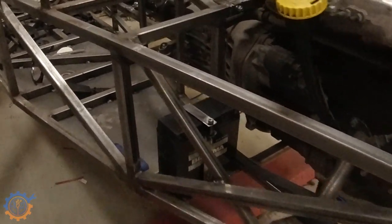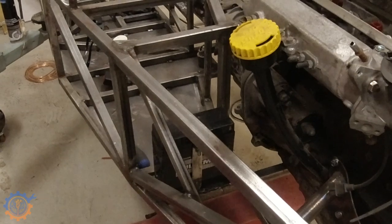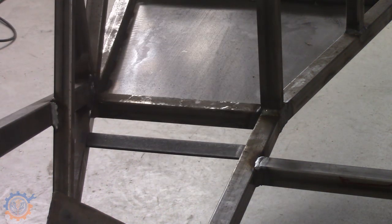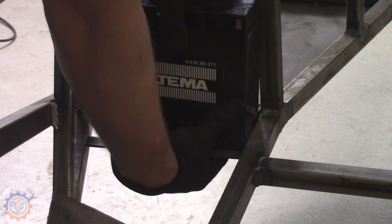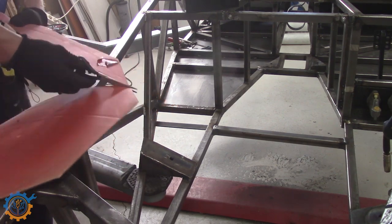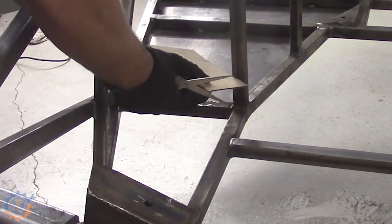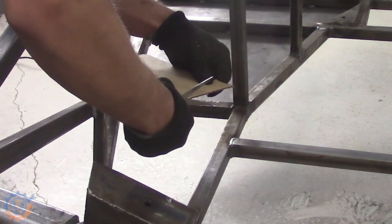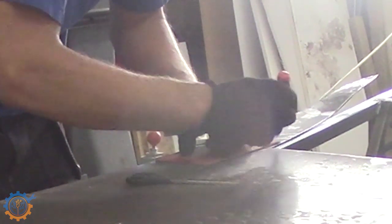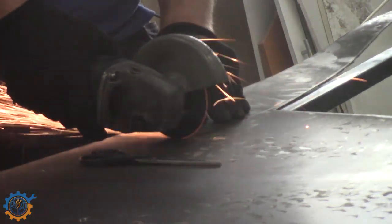We need to mount the battery here — you can see the finished contraption. Let me show you how it actually looks building it. I start with the bottom plate and a quick measurement to make sure the battery will fit as I want, and it looks good. Making a template out of cardboard is really recommended, especially when you don't have straight corners or specific angles to work with like in this case — marking out from the cardboard on a piece of steel and then cutting it with an angle grinder.